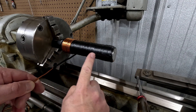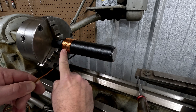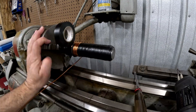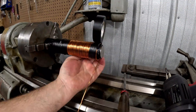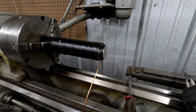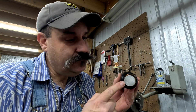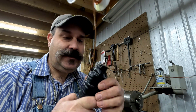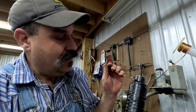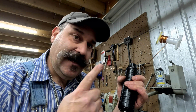We're at 53 feet — that's the end of that roll of wire. I'm going to go back all the way; this will be the end of the third revolution, and then I'll go back down to the bottom, making four evolutions around this rod. This will be the last leg down the coil for an end. So that's our first coil — that's inch and a quarter steel, machined and tapped at the bottom. I've gotten four complete wraps of copper magnet wire on here over about 6 inches, and it's taken almost 100 feet of wire.